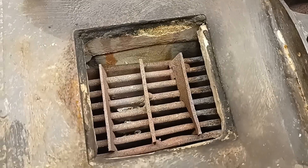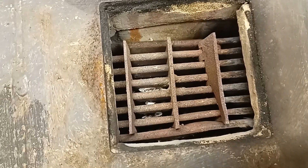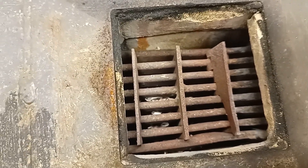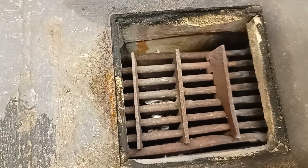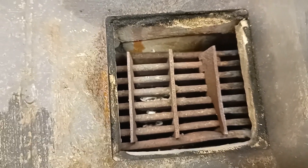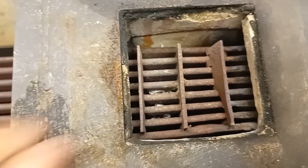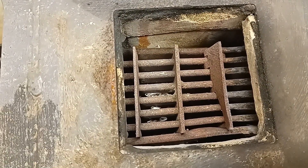There is a potential problem with the heat exchangers. I used mild steel because of the shape and they do bow in a bit, and I have hammered in these pieces to push them back into shape again. I think eventually they're probably going to fail. On future engines I would stay well away from mild steel and go back to stainless steel again. It was really just an experiment to see what you could get away with. My hope was that because the rocket stove runs really hot there wouldn't be enough oxygen in the flue gases to actually oxidize the steel, but I think stainless steel is probably the answer there.